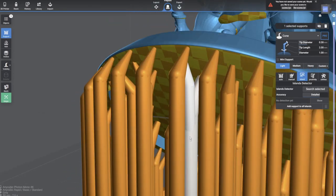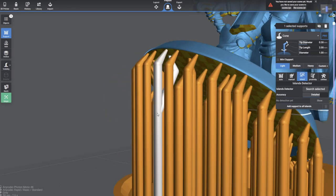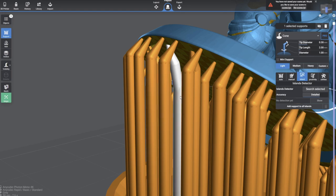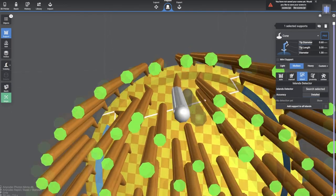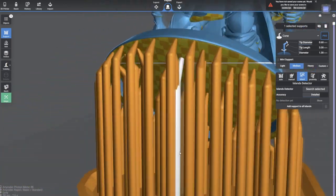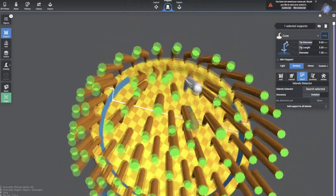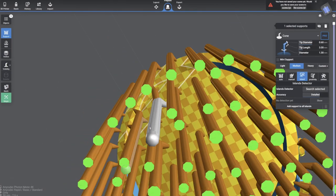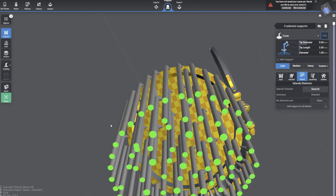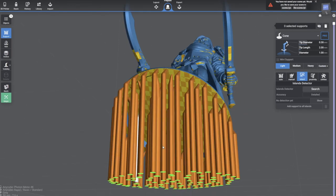I could actually even move the bottom of this, move it up like that, do something like that. Or if I wanted to, I could move it to a whole different support. But I think it's going to be best and the most natural for it to just come right off of that one. And I especially like to do this if it's a medium support underneath, or a medium support that I'm attaching it to, because that support has a bigger diameter, 1.3 instead of 1. And that means that this support is going to be less wobbly. The support's going to be more stable to hold up weight, so we could have maybe multiple light supports actually attached to this one. And that makes it a little bit more optimal, so you can still do some optimization and still save some money and maybe some headache when you're taking off supports.